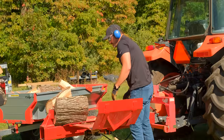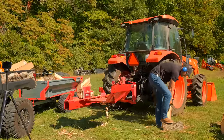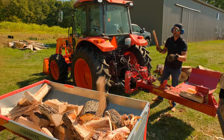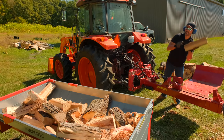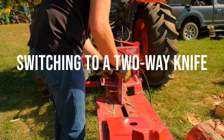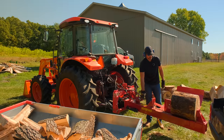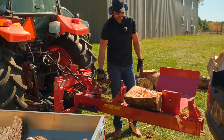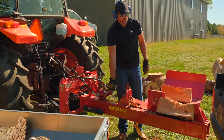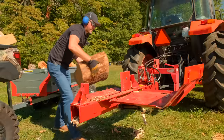This can split both ways. As I went along I got a better feel for it. In certain scenarios you can split going both ways — after you split a big log, put one half on one end and split one direction, then put the other half on the other end and split back the other direction. It takes a little getting used to, but it worked really smooth. We did run into some nasty elm — the same gnarly stuff we used in the firewood processor. That is some tough material, completely different than anything else. I had the tractor at about 2,000 RPMs — not at full throttle — and it didn't seem like I had much of an issue, so probably not the full hydraulic power it could put out, but plenty good for what I was doing.